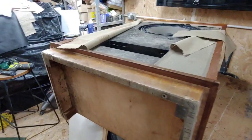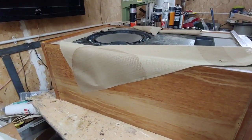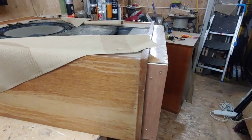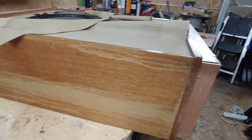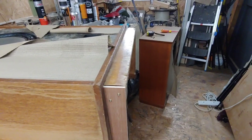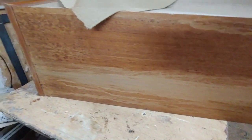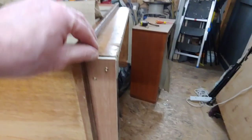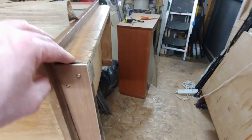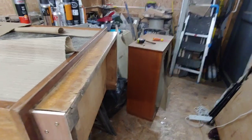These are all going to be stripped down — they're going to come up gorgeous once I've finished them. They're not going to be done in a high gloss finish; they're going to have a nice satin finish because teak originally was just oiled. You can see where they've all faded and this veneer is all picking up and lifting — it came out of an old school. There's no point repairing that; it's going to be better to replace it.